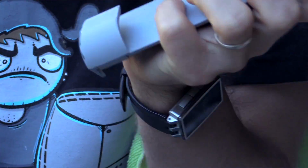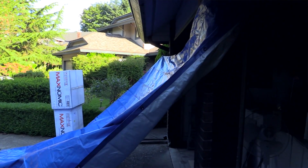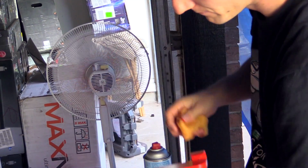We were able to help ourselves out a lot by covering our work area with a tarp, but even then we'd get dust problems with almost every coat. The best advice I can give you now that I'm finished the project though is no matter how tempted you are, don't try to fix anything while the paint is wet.